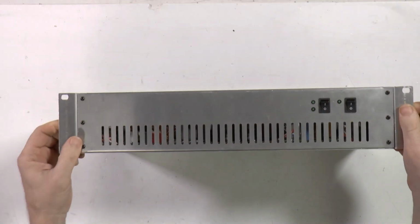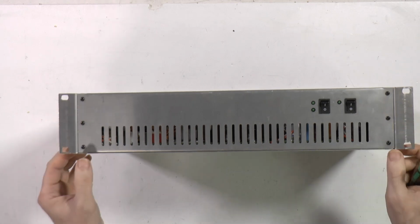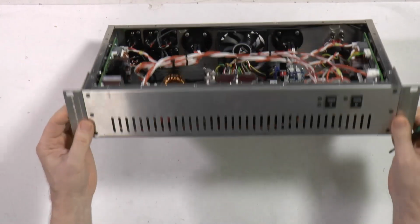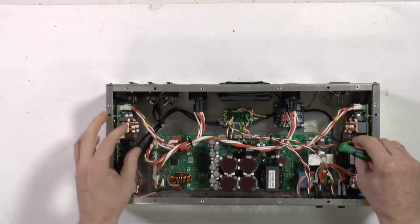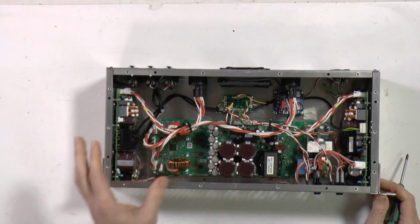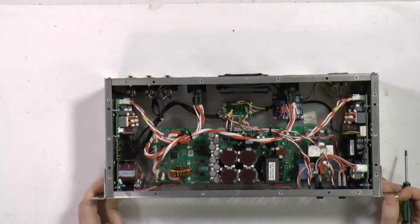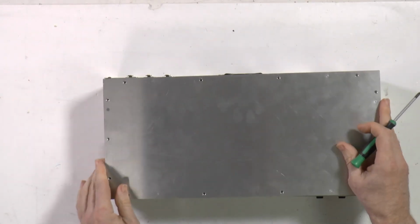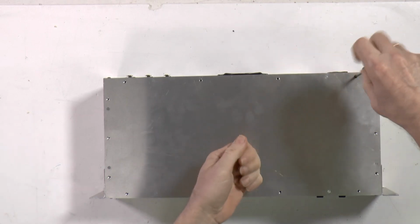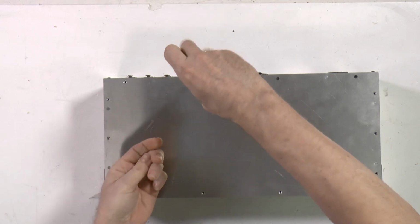The best way, anyway, is to disassemble that enclosure or chassis. There are 3 screws in the front, some screws on the bottom, and some screws on the back, and then you can completely remove the sides, assemble the board, and then plug them in. That's pretty easy to assemble. And for the ICEpower 1200 AS2 board, you should secure it just to the back plate, and that's it. So, not much to tell. Let's put it together. I will screw. You have plenty of screws. For the top, you just need a Phillips screwdriver and can quickly screw it together.